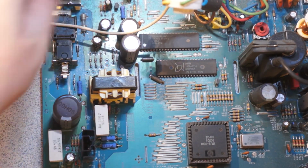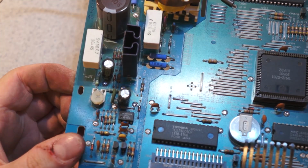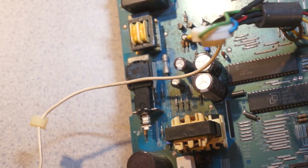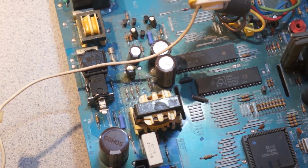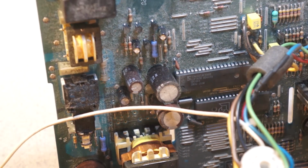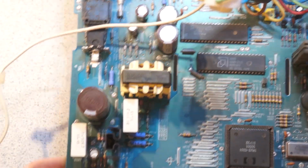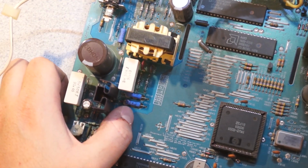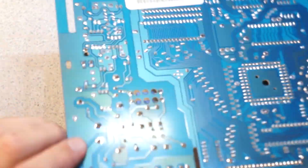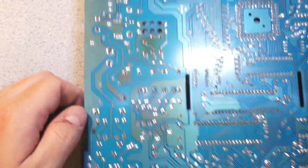And then you can see here's their DC to DC, which uses a UC3842AN. I think that's just a generic switch mode controller. Interestingly enough, I don't see any opto isolators. You can see we have 2 power resistors here with holes cut into them, so they're probably intended for circulation. And there's definitely an isolation gap along here. Wow, look at that. Look at the beautiful creepage distance maintenance they're doing down here. I mean, this is well laid out.